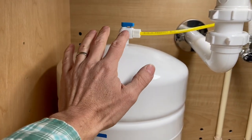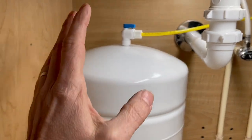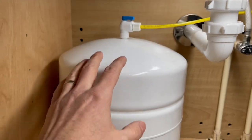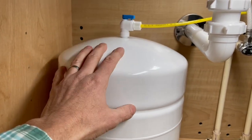Open the ball tank valve and let your tank fill for one to two hours. Then open the faucet and drain it all out — it will take about five minutes. Let it fill again, drain it out, fill again, drain it out — three times total. Let the tank fill, drain it out, and then you'll be good to go.